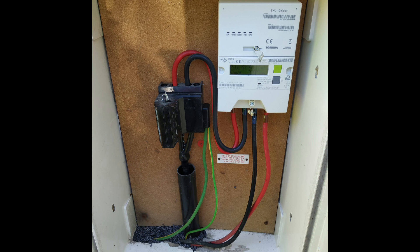In this particular case this is expanded polystyrene beads which have been put into the walls as cavity insulation. I've got a picture here of the installation as it originally was, and we can see there the electricity meter and the cutout. The cables coming out of the tails go into that thing at the bottom left through that polystyrene insulation spilling out of the cavity, and they actually go through the cavity behind and come out on the other side where the consumer unit is located.